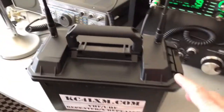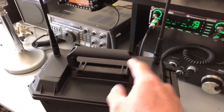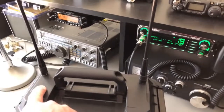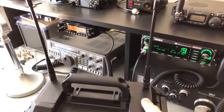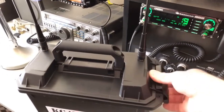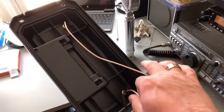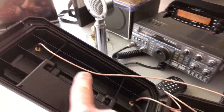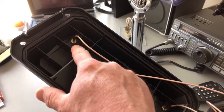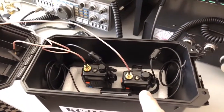So we'll take a quick look. What we've got is this small plain black ammo can with a carry handle, which is really nice because it's hollow so you can actually loop a rope through here to hang it up in a tree to get elevation if necessary. We've got the two rubber duck antennas — dual band, VHF and UHF. The basic components again are a couple of radios and jumpers. Here are the two jumpers — SMA female to SMA female jumpers purchased off eBay. They connect directly to the radio's antenna port, go up through a quarter inch hole drilled in the lid, put the nut on the other side, tighten it up, and screw the antenna on there. That is all of the construction that's necessary.